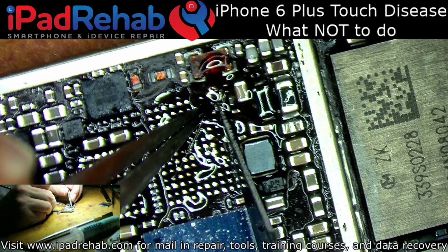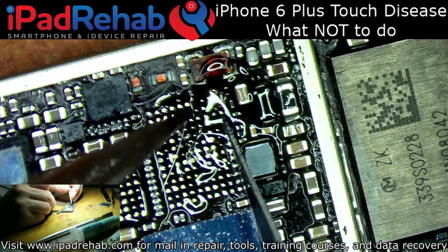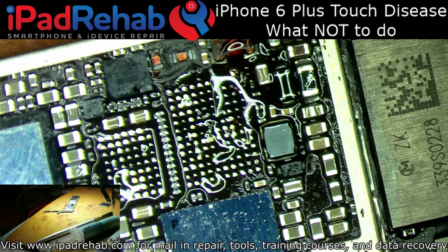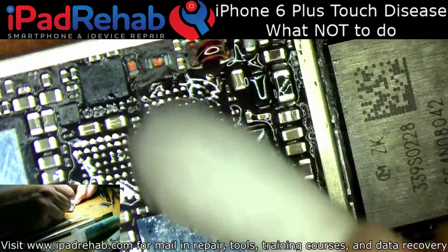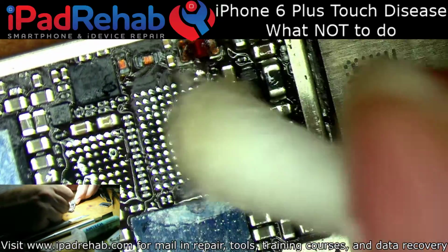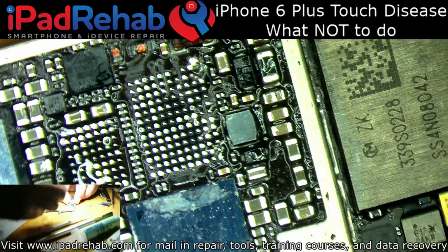Now, I am not a fan of running the jumper down the trace like the person before me did, where it's kind of a straight jumper from that via down the trace like that. And the reason, I would think, is obvious. We know that the root cause of the problem is the bending and flexing of the board, and that particular point being a weak point or a high stress point. That's the point of failure there.